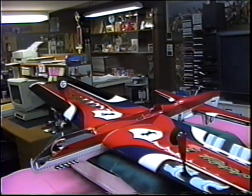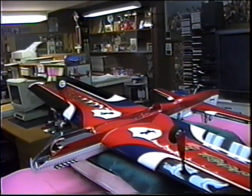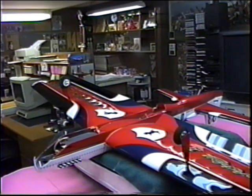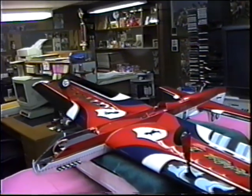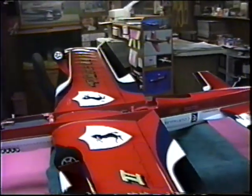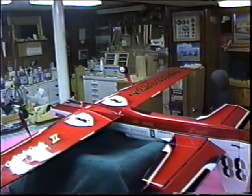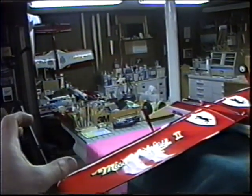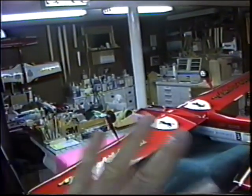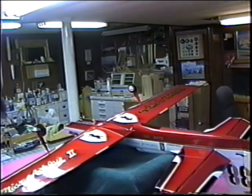The thing we want to do is fit up the pipe, and we have a nice selection of different size pipes that we've made, and see which are going to be conveniently fit and some are going to have to be forced to fit or won't fit at all. And again, when we made the bottom block mold, we only had 4 different pipe sizes. Now we have about 6, so it just gives us more choices in where they're going to exit. And of course what we want to do is do all the testing on the test bench, get them running the way we want them to run, and then fine-tune them in the plane, get that last little bit of adjustment on a pipe in the plane itself.